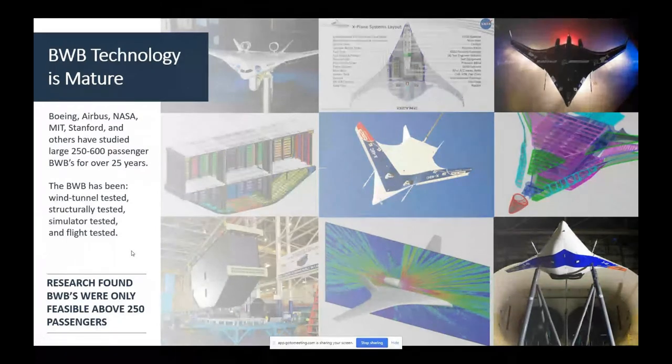Many of you who know about composites, they're special stuff. Metallics are innately fail-safe. If something cracks, usually the crack doesn't propagate because of plastic yield that arrests it. There's a lot of ways to protect yourself. So there's some modes in composites that aren't that elegant. There's not a lot of way to get ductile redistribution of stress. And so cracks can propagate, delamination can propagate, but this is a process where they stitched the layers together with Kevlar, co-cured the frames and stringers. So the outer skin, the frames here, and the longitudinal stringers were all co-cured as a single part. And you could cut through two bays and cut through one of those frames, and the structure was fail-safe. It's still a redistributed load and could bear the load. That's a first in composites.